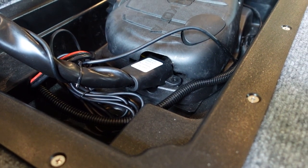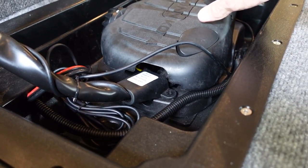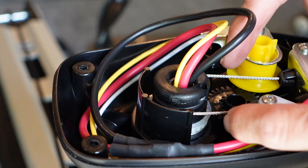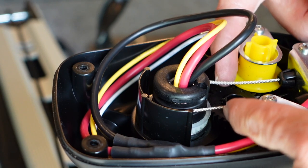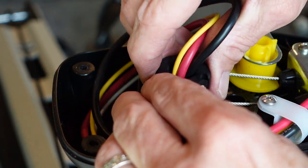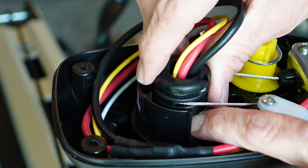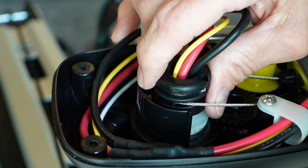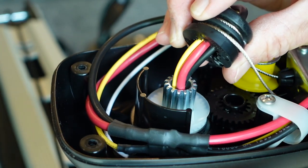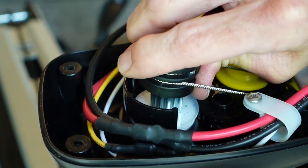Back that off about — mine was about 15 quarter turns. That will allow the tension to be taken off of this cable so we can work up in the head. Now, as you can see, we have the tension off. All we need to do now is lift this up — you may want to grab hold of your lower shaft — because as soon as we pull this off, it's going to spin, and that's okay because you want it to spin. You can see this is splined. We want to spin it in the direction you want it to point and then get this back on.